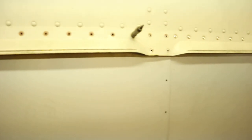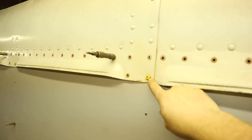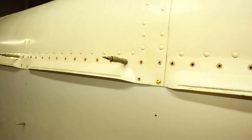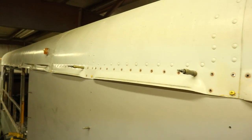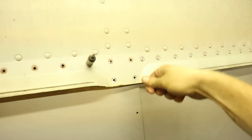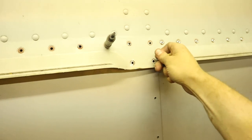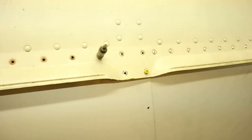So we're putting in another piece of sheet metal here, and I wanted to show you guys what we're doing. At the top, we're using these bus screws to hold the top gutter ledge down onto the sheet to make sure our holes are properly lining up. But it's a very awkwardly large space, so you have to sink a screw into a top hole and pull it tighter. This one's pretty close. I may be able to actually just catch this one.